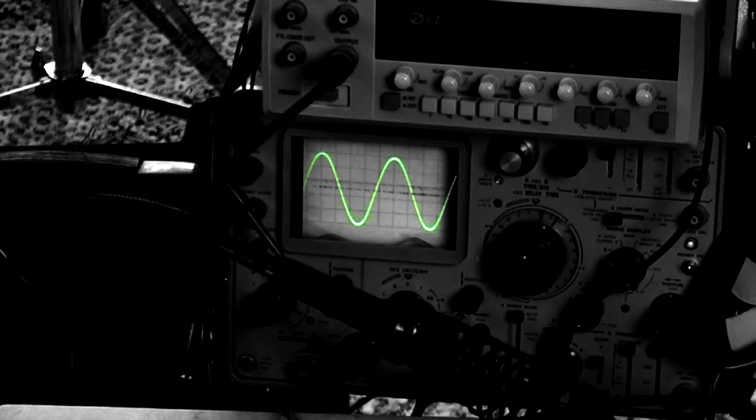Okay, what's the voltage now? Minus 25. Okay, if I put it a little bit less. This is pretty nice. Minus 31, look at that. Just visually I hit the jackpot. Exactly as on schematic. Minus 31. Great.